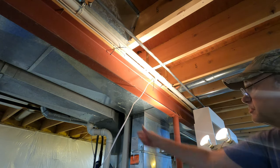There's an old saying that electrical current seeks the path of least resistance. Well, that's not really true. Electrical current takes every available path, not just the path of least resistance. It takes every available path. So then you can see why it's important to protect the end of this wire that we're not using. So I'll put a wire nut on it and wrap it with electrical tape. That'll prevent it from becoming a problem.